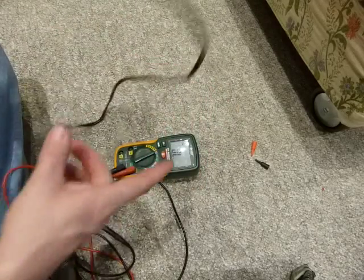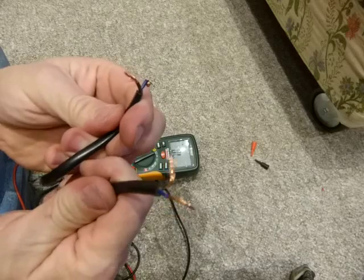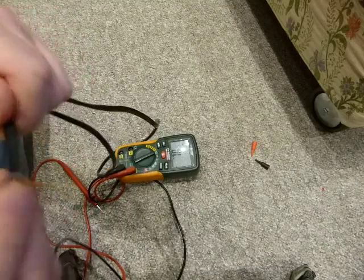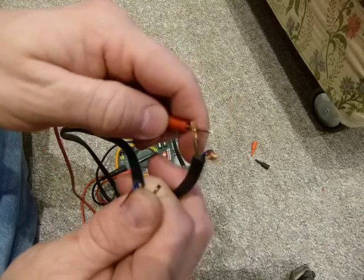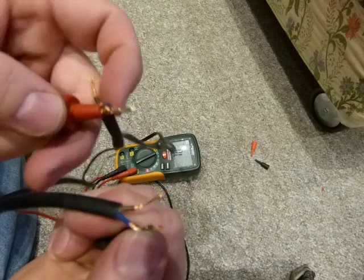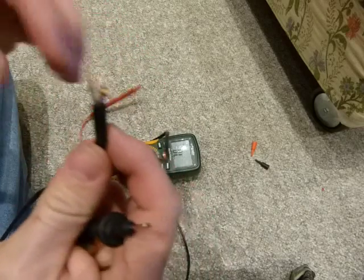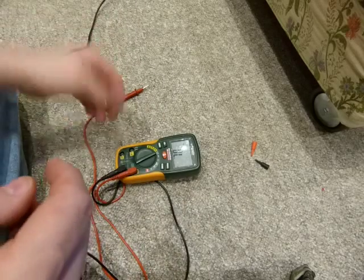This wire that was making my life miserable is broken inside. It had two molded connectors at the end and power just wasn't going through, so I had to cut the ends off because I was suspicious. The brown wire — when I connect brown wire to brown wire — there is good continuity. When I repeat it with the blue wire, there's nothing. If I touch the probes the instrument works, but there is no continuity from one end of the blue to the other end. The blue wire is broken somewhere inside the jacketing.